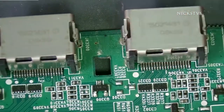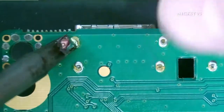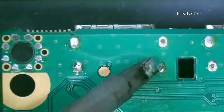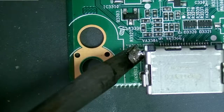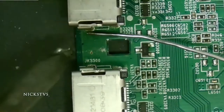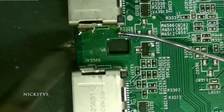All three of them I lined up properly here. I'm going to start with the ground pads. I'm also going to add solder from the front side as well. I haven't added any flux yet, but I'll come back and touch these up in a minute with some flux.